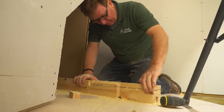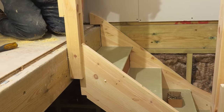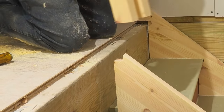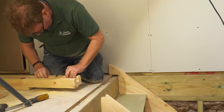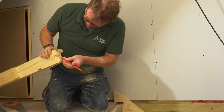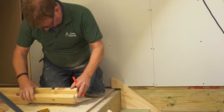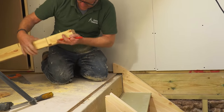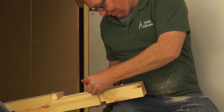As Mark explained from Surrey Staircases, they just leave a 1 millimetre gap, just enough to slide the tread in with the expanding polyurethane. And it really just tightens it right up. The screws are just there to hold it in position whilst it's going off. This is the important thing: people look at that screw and think it's doing a structural job, but actually, once that polyurethane glue has expanded around the whole of the housing, on all sides, it's there. And the screw stops it spreading apart.